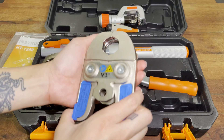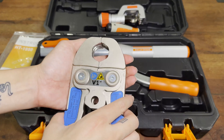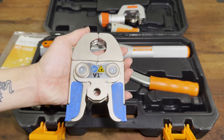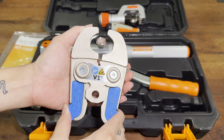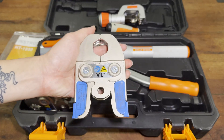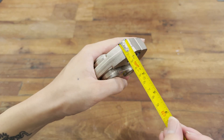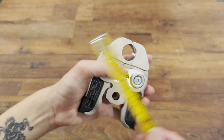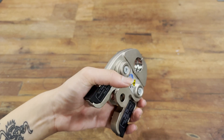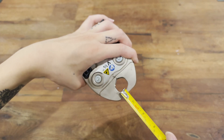This tool has individual jaws. The reason I had leaks with the previous press tool was because the jaw inserts for the universal head were metric and they were shipped by mistake to me in the U.S., where we use inch pipe. These jaws, however, are clearly labeled as being for North American V-profile press fittings. I also like how compact these jaws are so you can easily press pipe fittings in tighter spots. The jaws are only about an inch thick so they can press T fittings with ease, which is something the previous tool could not do. Plus they're overall compact and look just like the ones found on professional press tools.